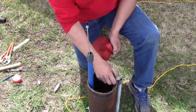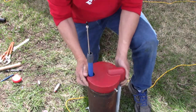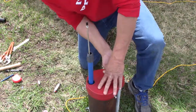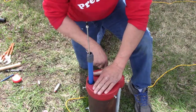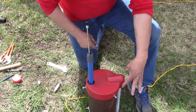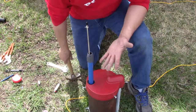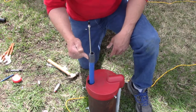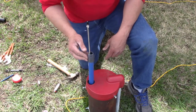Reinstall the cap. Make sure your electric wire has a nice clean bend, then replace the cap over the blue drop pipe and re-tighten the bolts. Now if your hole is off rotationally, you can tap that well cap around to get your alignment. The flex in the pipe — because we had that U-bolt down 10 inches — can usually absorb any offset.